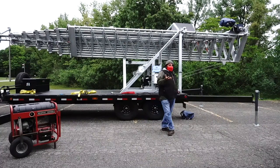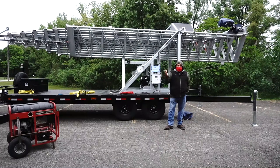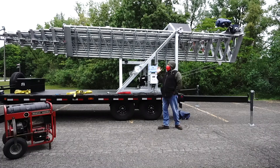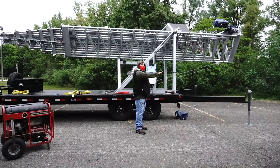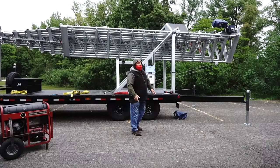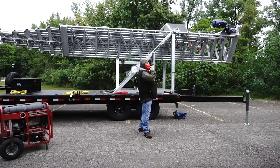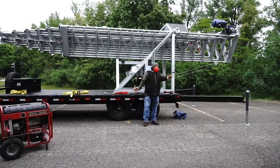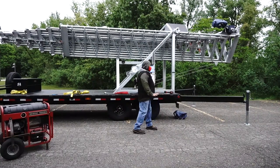Let me tell you, we have towers everywhere. I think maybe one or two of the people use the reel. Why? Because when you put the tower inside, normally 2 or 3 groups, teams with trucks, come. So the guys put the guide wires on the floor and put them in the truck and never use the reel. It's easy, but we recommend being careful, because maybe the same team doesn't deploy the tower next time. And what happens with the guide wires? You need the guide wires, okay? So that's talking about the reel.